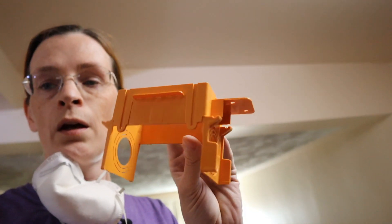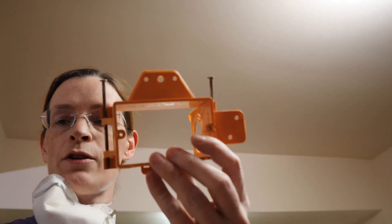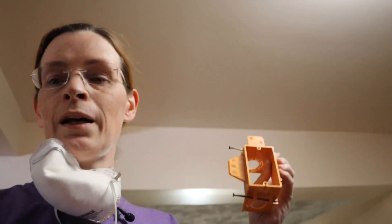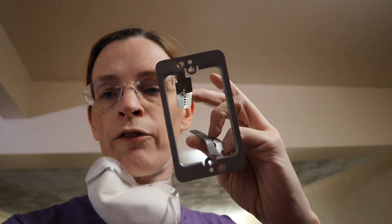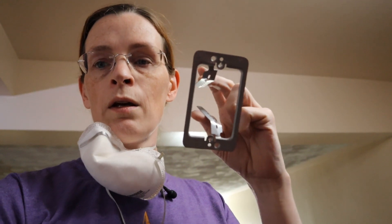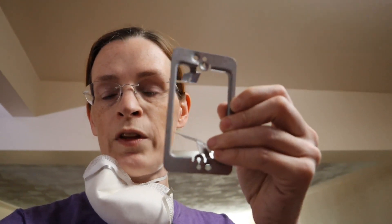It'd be nice if I could use one of these, however it's missing the nail — it's supposed to have a nail on it. To get the nails driven in you usually have to cut a pretty big hole in the wall. I don't want to do that because I painted this like a year ago. In my day job in IT, it's not uncommon to use one of these to drop network cable connections. You just poke a little hole, put a screw through here, fold the flap up, and the screw grabs it and pulls it tight against the wall. You can only use it for low voltage, but it means your hole can be a lot smaller and a lot prettier. So I'm hoping to use one of these in the orange box.